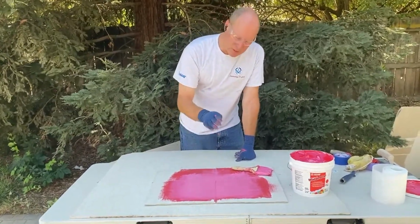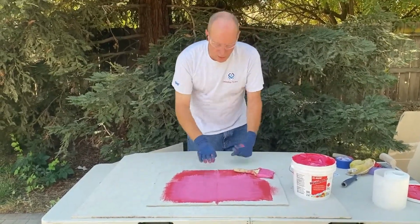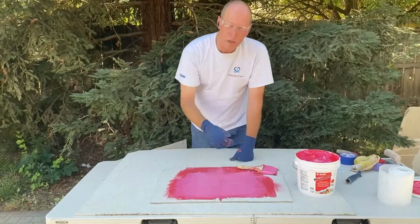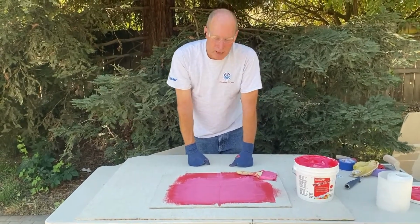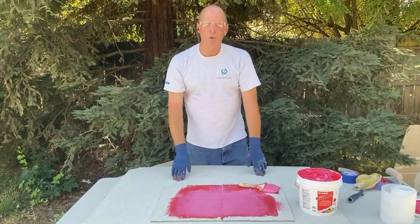However, many times the best way to honor these types of joints is to have them come all the way through our tile work. Our tile should end on both sides of this with a backer rod to keep it free at the bottom, and that's going to allow that joint to move the best way possible. So that's how we do fabric reinforced waterproofing.